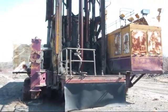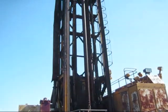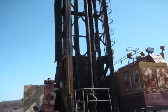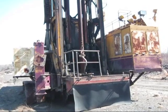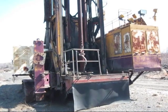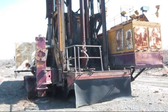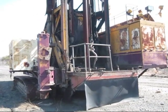The 60R was designed by Bucyrus-Erie to drill holes up to 12.5 inches in diameter with a bit loading of 90,000 pounds. Later on, in 1979, an improved Series 4 60R was introduced with an increased bit loading capacity of 125,000 pounds. By no means are the 60 and 61R blast drills small. These are large rotary blast hole drills designed strictly for production.